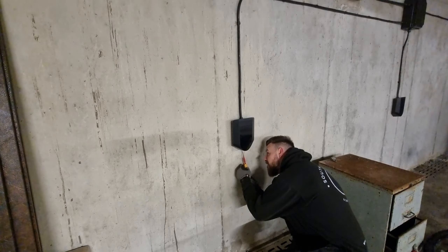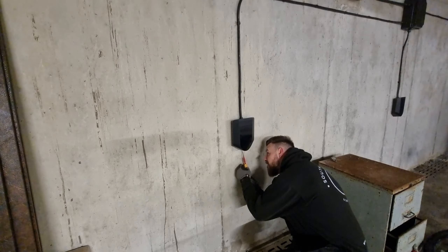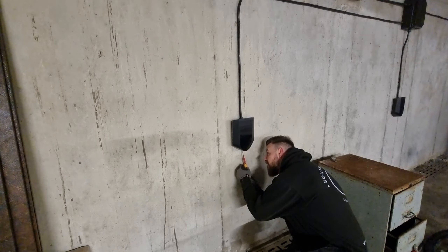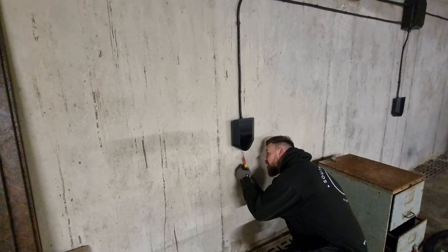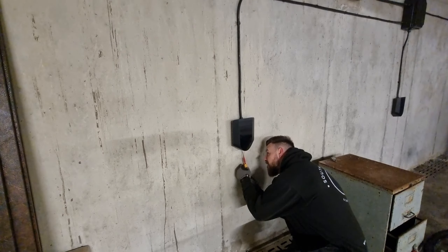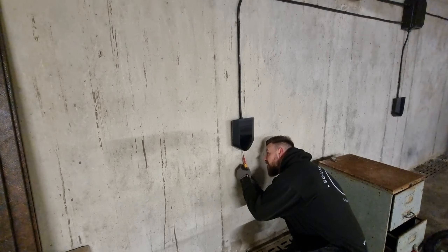Up in the mains cupboard — the little plant room — I'll hand over to John from Faultless Electrical. John: we've come off the switch down here, had a big shutdown that went reasonably well, run our flexi tails up here into this new 100 amp switch-fuse. The fuse is disconnected while we're still working, but it's live at the top. That's feeding the 5-core 25mm cable — the run is about 70 metres. I allowed for 85 metres in case the route changed. It runs down and across the ceiling in the foyer. Back to the car park — cheers John.